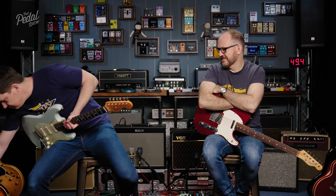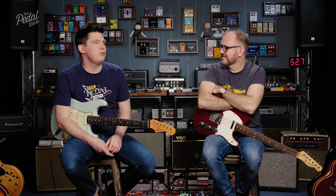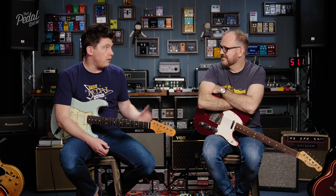I always found that really interesting, because it's about much more than what your output valve is. In fact, my dear friend Martin Kidd, when I asked him what the difference between an EL34 and a 6L6 was in Victory's amps that have them swappable, he said virtually indistinguishable until you turn it up. Wow. So it's a part of it, but it's not until they start overdriving and doing their thing that the big differences come in.